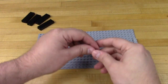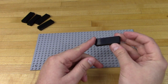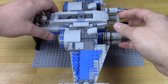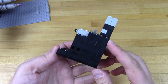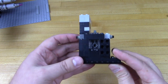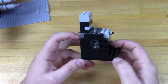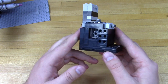There are many ways to mount your X-Wing onto something, but we're using this large gray plate and these large black bricks to do that. The important thing is that your X-Wing is nice and secure on the plate and that there's space on the back end to house the gearing and the electronic parts. How you do this is entirely up to you based on what LEGO pieces you have available. We're using a single worm gear to drive that larger gear up above. This gives a lot of torque at a slow speed, which is what we need to manually move those X-Wing wings up and down.